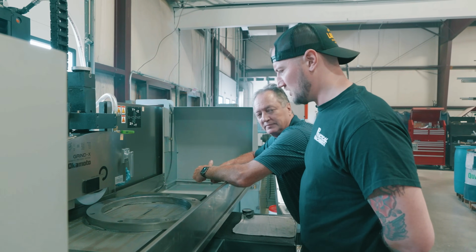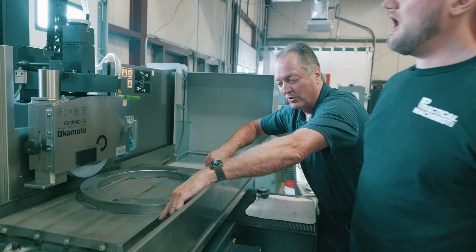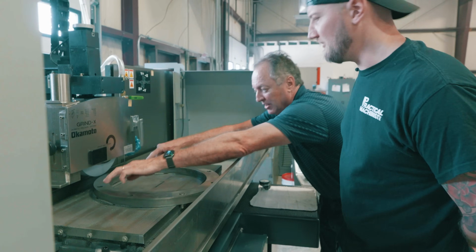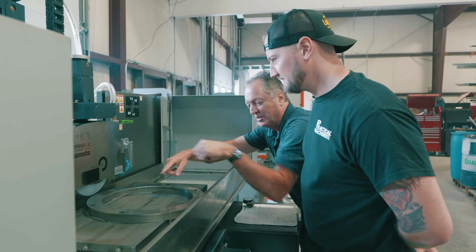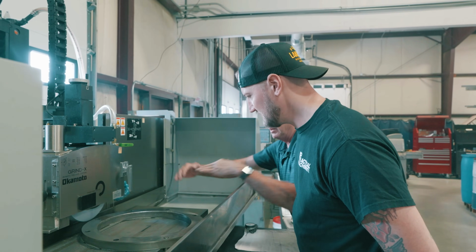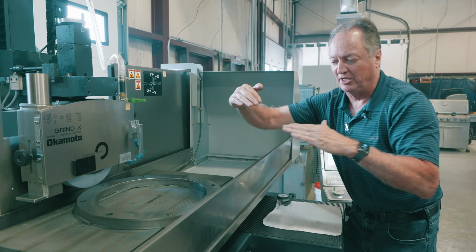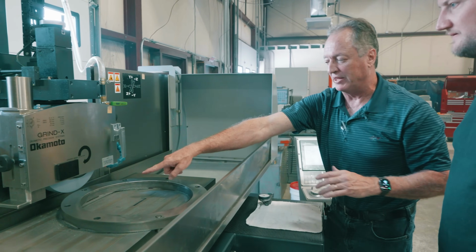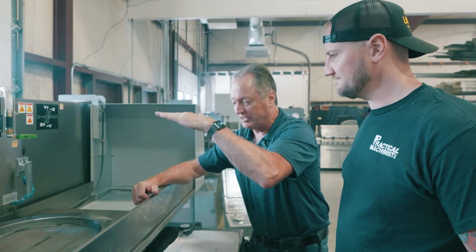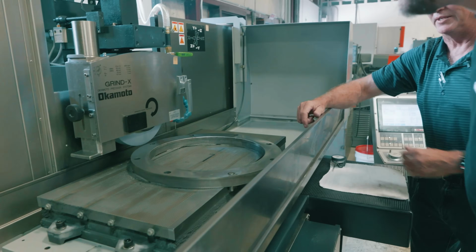How do you turn that around to pick it up and have it be square? We're locating on two dowel holes and locating against the vise right there. So we know that we can get these two on this quadrant, and this is equally spaced, and we can rotate it around. That's how we'll do it. The advantage there is the part's sitting like this, so we've got this flat, and the tilt is on the downside by the shimming. We indicated that zero right there, and now we're taking it down to reestablish an outer sharp edge right there at the pressing.